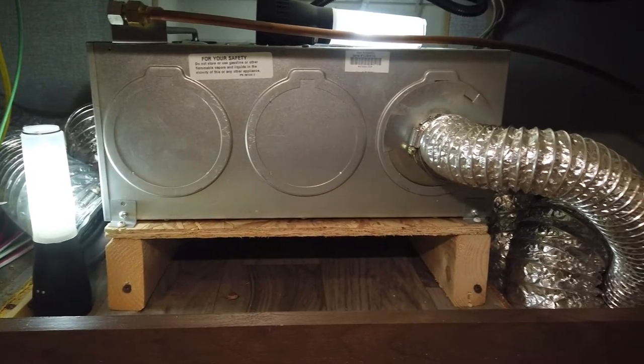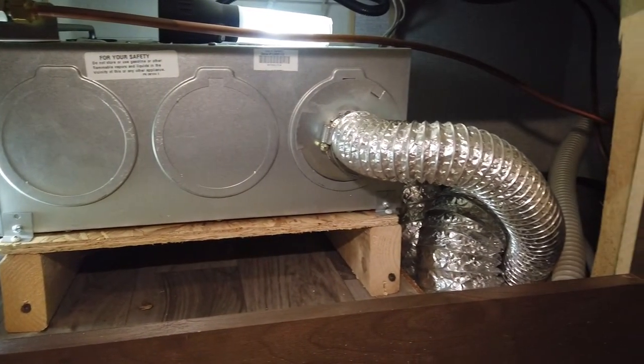The sail switch and the motherboard — the two most common things that go wrong on furnaces — are right on the other side of that wall. So you've got to get to it from the inside. The furnace is under the fridge, and there's no access panel outside. The hardest part is disconnecting and reconnecting the air ducts to the furnace.